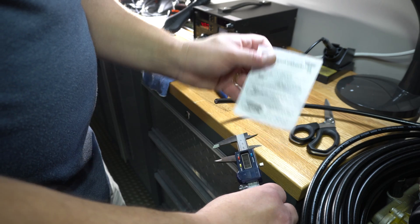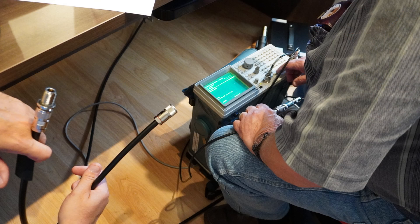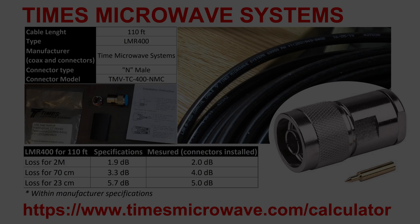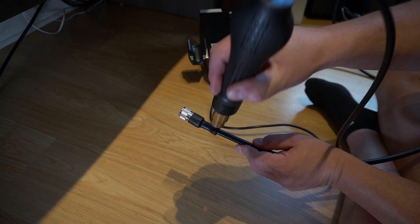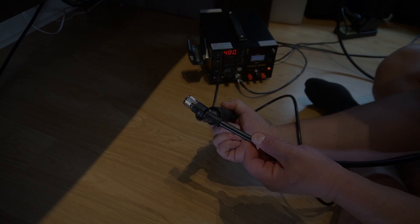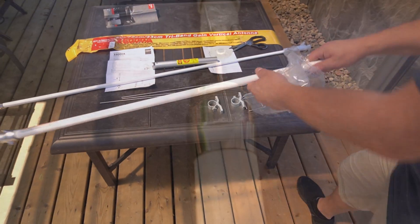The first thing I did was install the connectors following the manufacturer's instructions. Then we brought both ends of the coax into the shack so we could test with the spectrum analyzer. You can find a table here showing the manufacturer's specifications for coax loss versus our measured results with the connectors installed — it's pretty close and within spec. We then installed heat shrink on both ends. We also tested the triplexer in the shack, and what we measured was pretty close to the manufacturer's specifications.